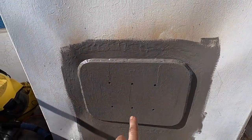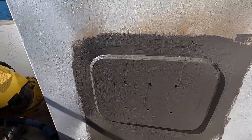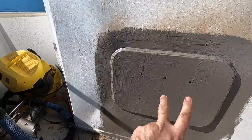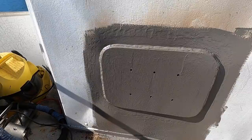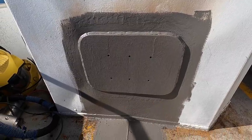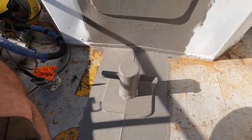I've got the plate welded on with a bit of epoxy primer on it - I had some bolts in the holes so we don't have primer in the holes. It's a little bit of a booger weld, particularly on the vertical up, but top's the easiest. There's loads of metal there and I did it quite hot, so I think there's pretty good penetration. With almost four feet of weld, a 14mm rope is going to fail before that pulls off the wheelhouse. I got this welded on too - really awkward, but just piled it up with about five passes, so that's not going to come off either.